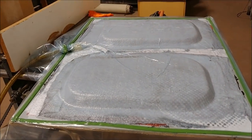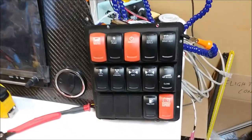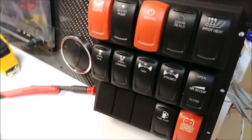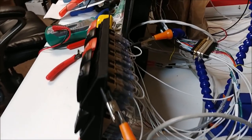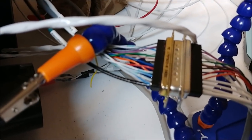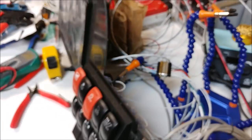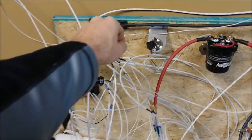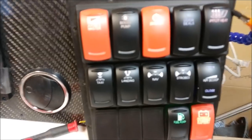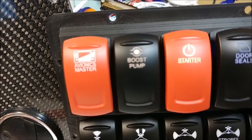Back on the avionics, I've been progressing through a whole bunch of things, working through my list from the CAD. The next thing was to get the switch panel finished up. You saw last time I was wiring it all up at the back — anyway I got it all wired up, and I've got a DB25 connector in there which is connecting next to the panel right now. When it goes in the aircraft there'll be a patch line running up to the roof with the DB25 on it.